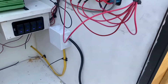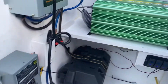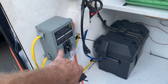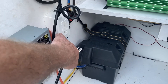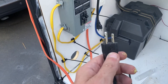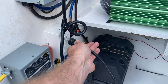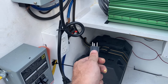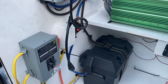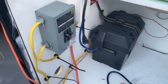I added a transfer box for the plug. The reason I'm doing this is because I have an inverter, and down here I'm going to have shore power. I ran a 20-amp and a 15-amp breaker. The 15-amp comes in and runs from here to this outlet. When hooked up to shore power, I can plug in the pigtail that runs to all the outlets. If shore power isn't available, I can use the inverter — so you can't accidentally run both at once.